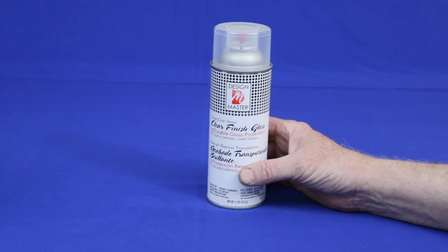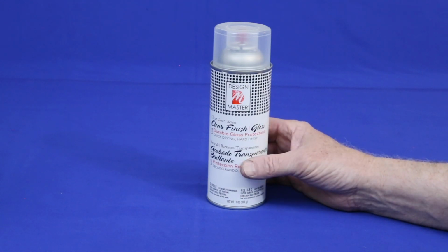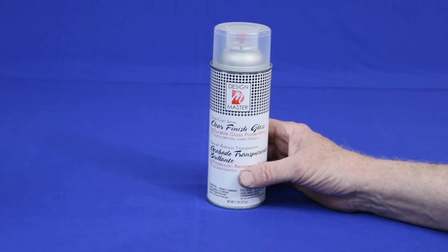I assumed the cause was how thickly the spray was applied. The fact that I worked hard to spray as evenly as possible and some areas blistered while others didn't suggests the threshold for blistering is very sharp. Just a tiny bit above it, and there's enough solvent in a layer of clear coat to start the blistering. As long as the amount of spray is kept below this level, there should be no blistering.